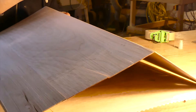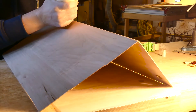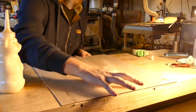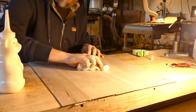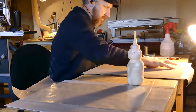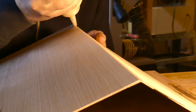I've thickness sanded these laminations out to one-third of my top dimension. I won't force you to watch the hours of tiptoeing back and forth around the drum sander this took. If you thought this method was easy, I beg to differ. I don't need an excellent bond on these thin edges — I'll be overlapping these joints anyway. It's just a way to hold them together until the flat faces are glued up. I still put in the time to make these joints as clean as possible.